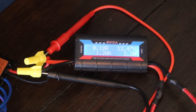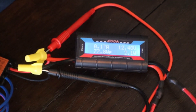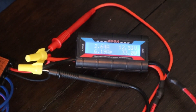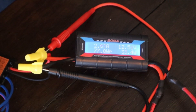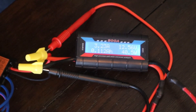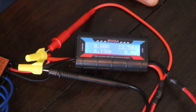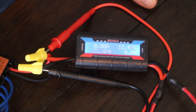You'll see the watts going up. I'm not going very fast — you don't see the voltage go up because I'm not exceeding what the battery is already at, which is 12.4 volts. I'm going to speed it up. Now I'm at 18 watts. Go a little faster — now you see the voltage starting to creep up to 12.5 volts. 40 watts — I hit the overbrake by squeezing a little too hard. So there you can see: they say this is a 500-watt unit and I'm reading 40–50 watts coming out of it. There's your bench test.